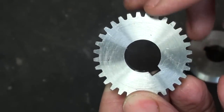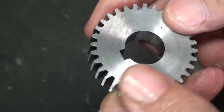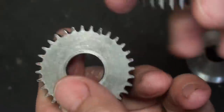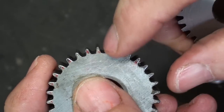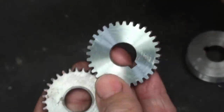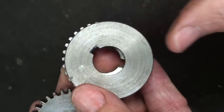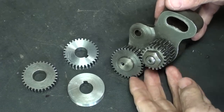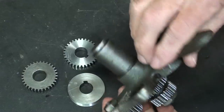Okay, here it is, and I'm really surprised at how well it turned out. I've got some deburring to do on this side — I'll probably put it back on the arbor and stick it in the lathe for that. No biggie. But this is the worn-out gear, and you can see that it is going to mesh all right. Look at the difference in the shape of these worn-out teeth compared to this new one. I have another one to make — it's so much quicker to cut a gear when I'm not filming it. There may very well be a follow-up video where I make the other gear and mount them on the reversing mechanism here.